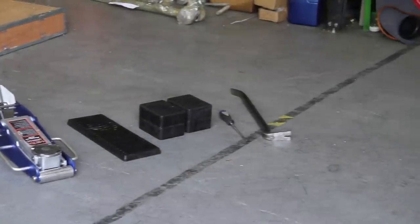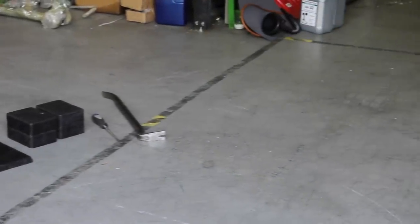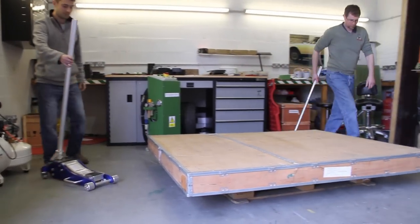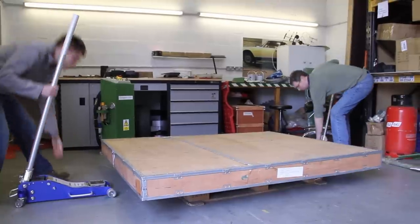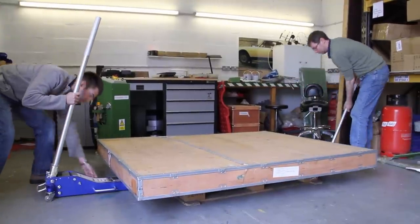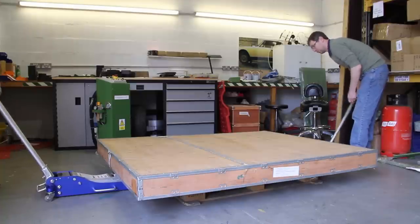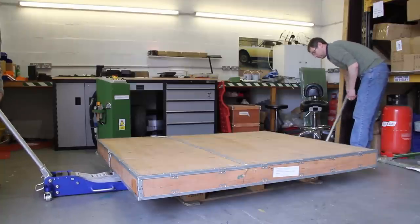We think that you probably will have access to these tools — for example, a couple of trolley jacks, a crowbar, a hammer and suitable screwdrivers. The lift will have been delivered on the pallet truck so it will be up in the air. The way to get this off without the use of a forklift will be to carefully employ two people with a couple of trolley jacks.